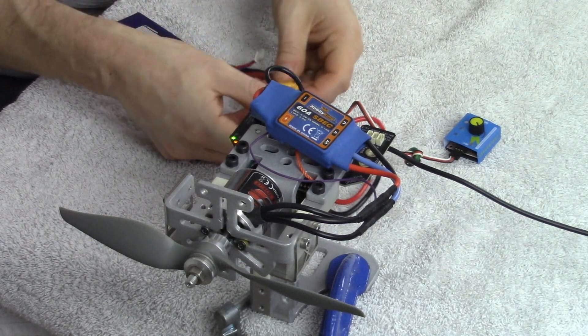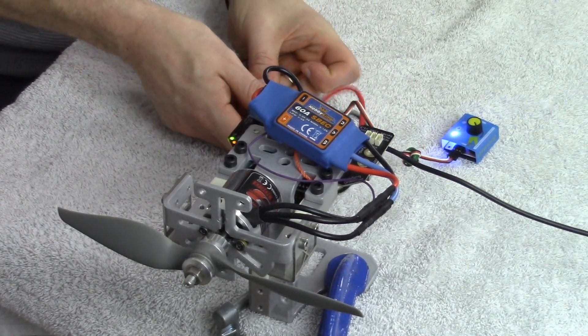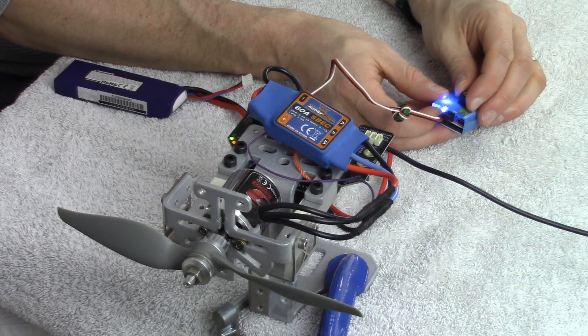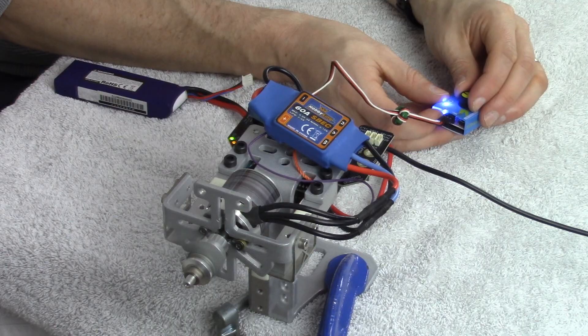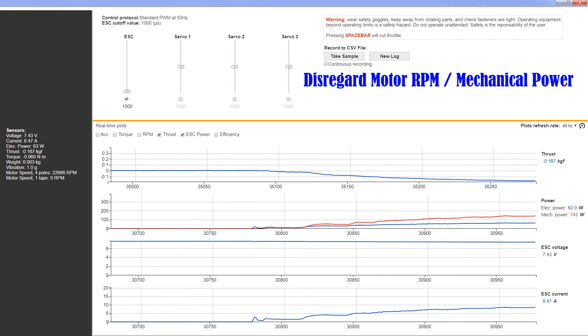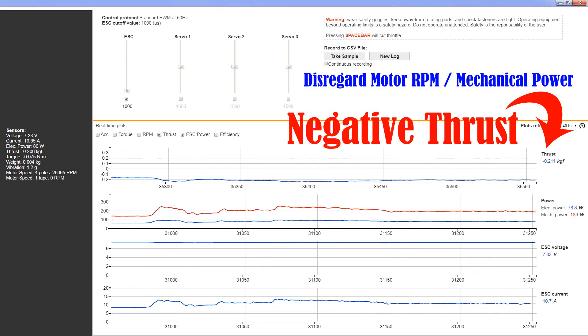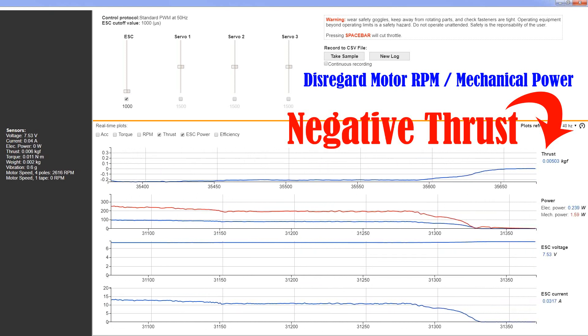Now I'm going to plug this pack back in so we can power back up again, then we'll get our initiation sequence, and then we can go and rotate that motor, firing it up yet again. So the rotation of the motor — we should see that now. We can already tell that the reverse direction is there because the motor is wanting to push air now in the completely opposite direction, and it sounds quite different. That's how you go and reverse the direction of a brushless motor where it is sensorless.